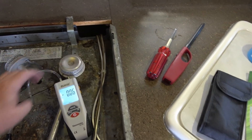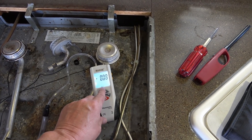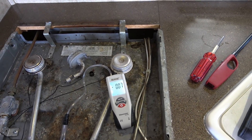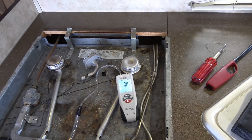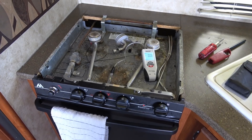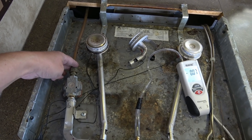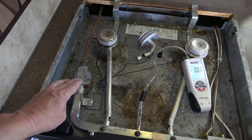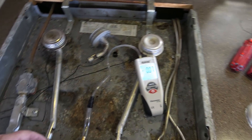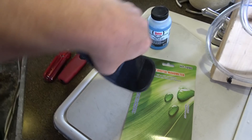So today I'm going to test that. I've got it set to water column inches of pressure - that's really the standard they use. I think the RV one is around 11 or 12 somewhere in there. But I know this Atwood stove runs right, and if I look at their regulator, they say they want 10 water columns. They have a little regulator here that drops the pressure down from whatever the RV is running at down to around 10 water columns - at least that's what their manual says.